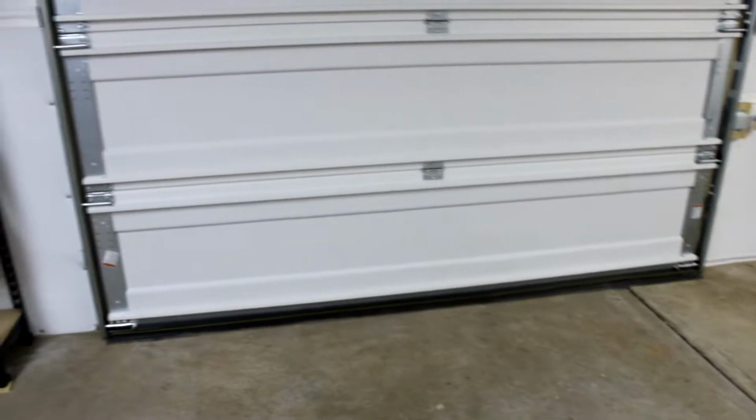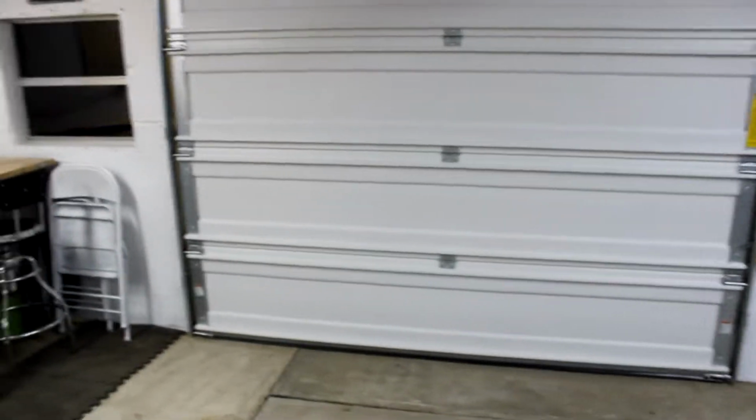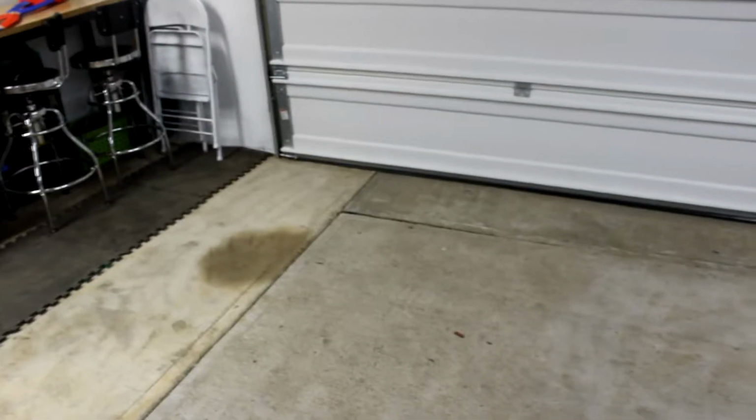And I have put a seal that runs from side to side to the back door there, because the concrete pad does go out a little farther than the border of the garage, as you can see. So I put the seal there so the rain gets blocked and it doesn't just run right in here down my floor. The front one doesn't really need it because when it rains it runs downhill anyway, so there's really no splash in from that side.